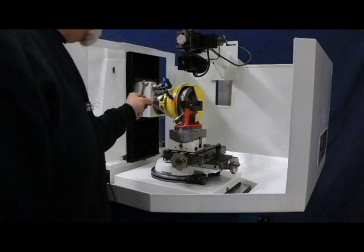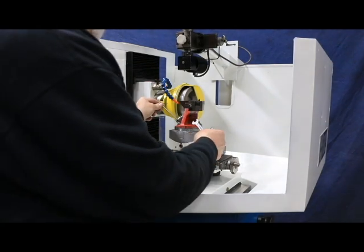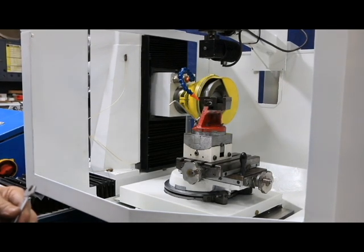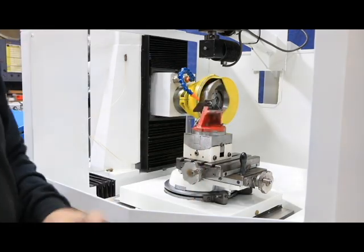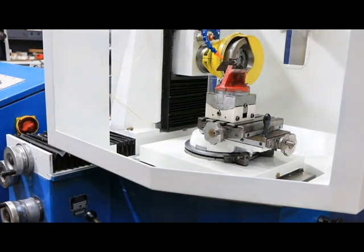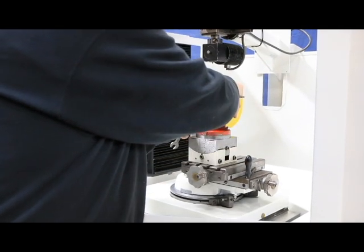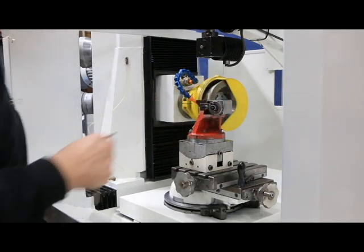The fixture here needs a little something to loosen this screw clamp. If we lock this down with a 10mm wrench so that it doesn't move, and shut that spindle off — when you loosen this up, that drops down and you allow it to take your little tool holder off. So you can put whatever you need in there; in this case they're sharpening one of these carbide inserts. There's also one for holding a small type of collet. It goes in here and you clamp this, and once you tighten this clamp on the side, that's locked in nice and tight. And this can be rotated — there are different things you can do with that.